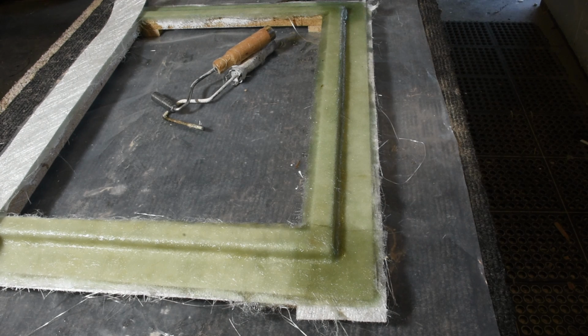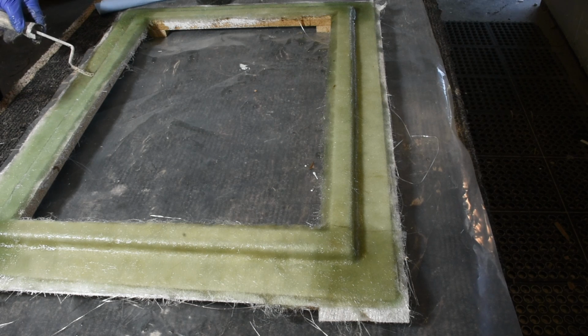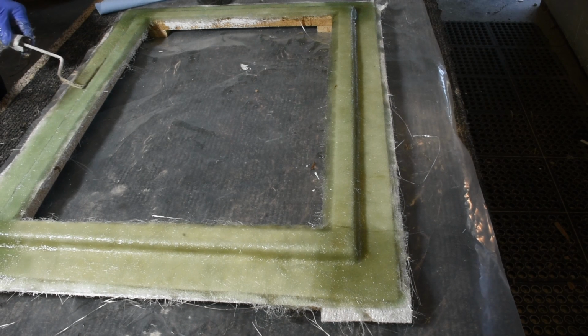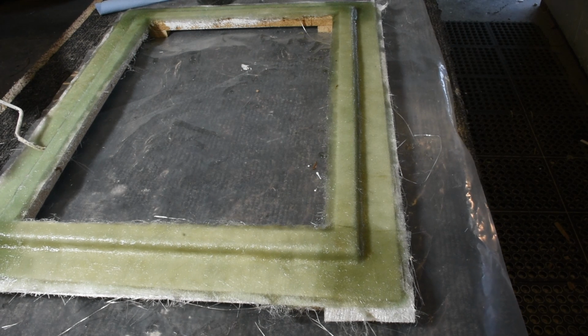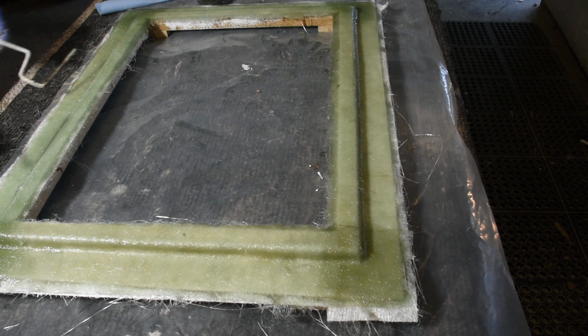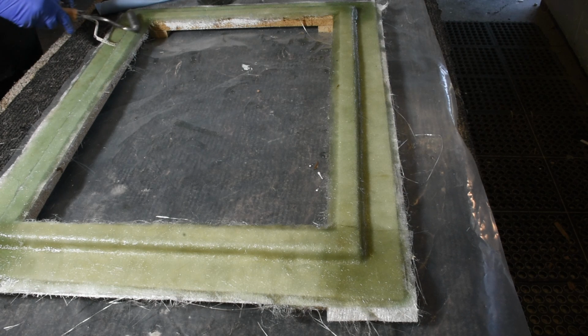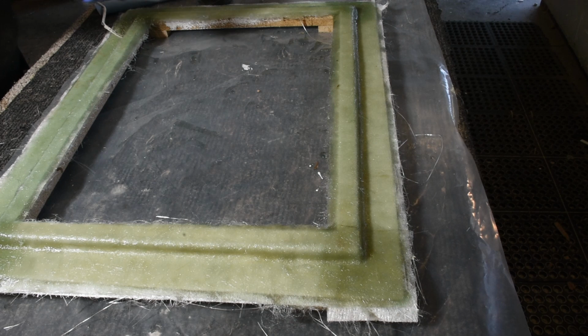We're just on our final passes. So we've got 2 units on both. And you can see I'm taking my time to push in the corner. This is a common mistake. That's why I'm spending so much time showing you the corner being done. People will roll out their mat and they're pulling it away from the corner, and you'll have big voids in it. But you're going to take your time on the corner.